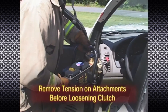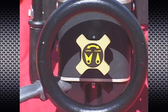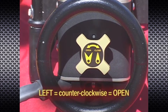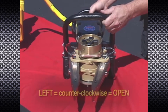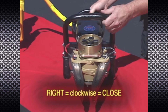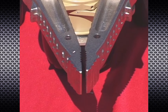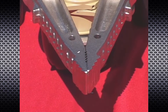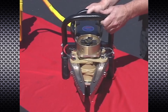This will allow positioning in the complete 70-degree range of motion. Activating the trigger switch in the back of the unit operates the rescue tool. Turning the switch to the left or counterclockwise will open the attachments; turning the switch to the right or clockwise will close the attachments. The rescue tool is designed to shut off automatically when it reaches maximum force. When this occurs, reverse direction to relieve load and reposition the tool.